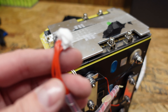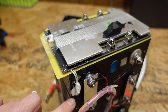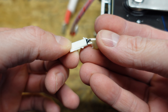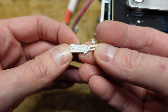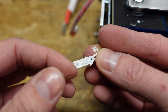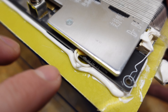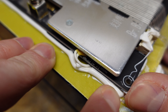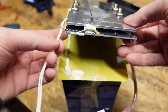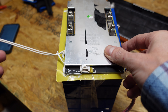As I removed the balance lead and negative, I initially didn't see any temperature sensors on this BMS. However, there is one on the side properly affixed to the cell. Unfortunately this appears to be a thermal switch, not an actual temperature sensor or thermistor. The sensor itself says 75 degrees Celsius, which I'm guessing is the point at which this switch will turn on. So I don't believe this battery has low temperature charging protection. There appears to be a second one on the left, but it turns out it's the same sensor — they just ran the lead under the BMS. There is only one temperature sensor on this battery.